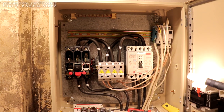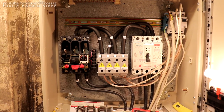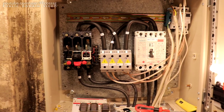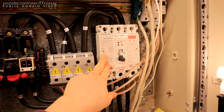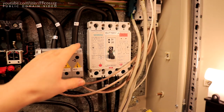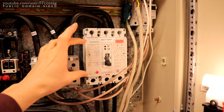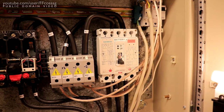Mounted inside it we have two reasonably sized circuit breakers. These are 160 amp breakers, 600 volts DC rated, so these are way overkill for this system. We could deal with some that are smaller, but I had these at hand and I don't have any better use for them, so why not.